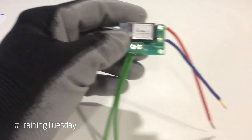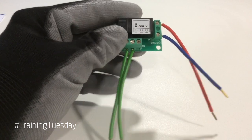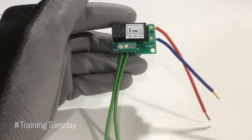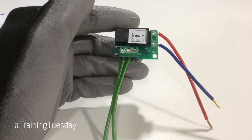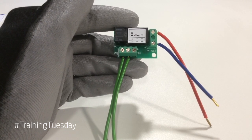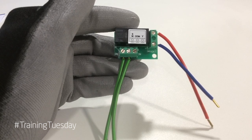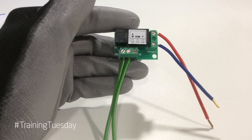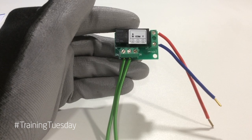The relay board itself has four wire connections: a red, a blue, and two greens. I can see by looking at this relay board it's set up for an S plan or W plan configuration. The two green wires tell me that the green wire in the center terminals are common, and if it's set into the left hand terminal as shown, that is for an S plan or W plan system. If I wanted to configure it for a Y plan, I simply remove the green wire from the left hand terminal and place it into the right hand terminal for a mid position or sure flow valve.